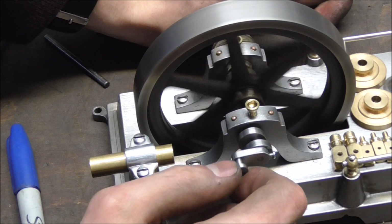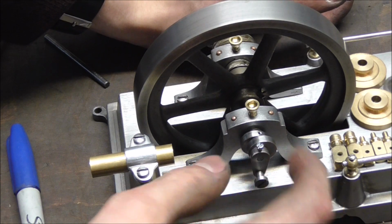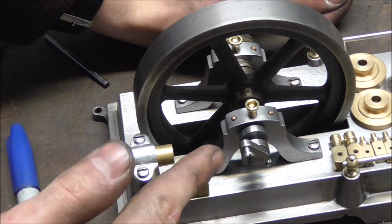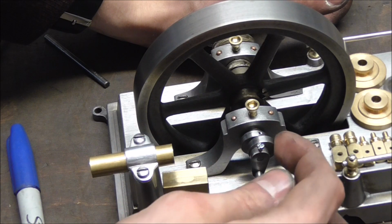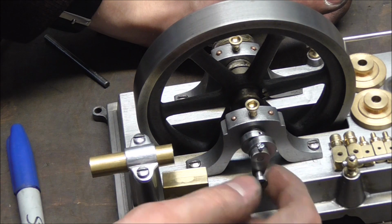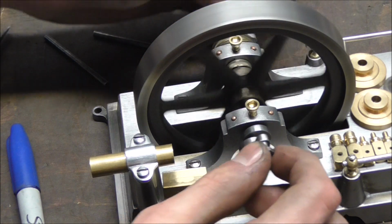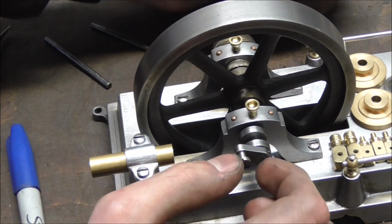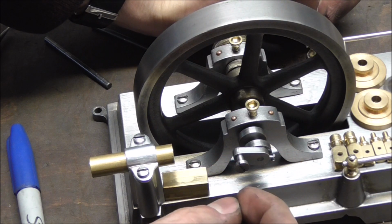The other reason I made this out of steel is because on the original, if I had it brass, I would have of course needed to nickel plate all this, and then all my fits would have gone away. Like for example the eccentric on the crankshaft, the crank pin in the crank, and so on and so forth. This way I'm skipping all of that and don't need to worry about any close tolerances.